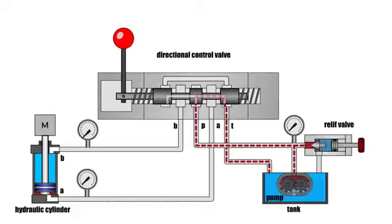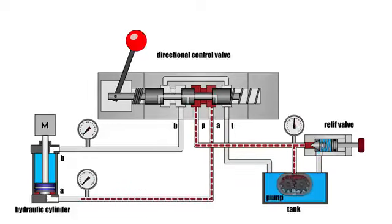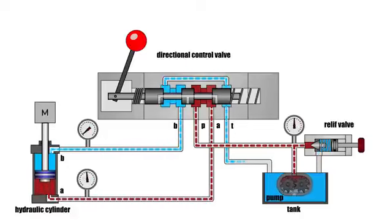Such a directional control valve is usually called a 4-line one. Its spool can have 3 positions, so we've got a 3-positional directional control valve. In the neutral position, the pump line is attached to the drain through a channel inside the spool. Such a scheme makes it possible to offload the pump when the drive doesn't move and doesn't keep the load. Hence, we save energy.